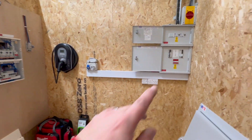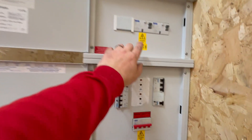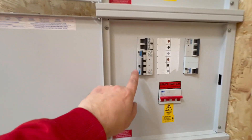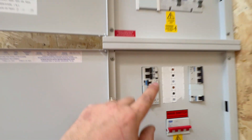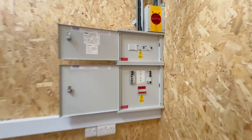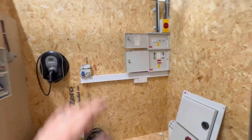This board is in our EV booth. You can see here we've got the old-style Proteus EV board. These used to work via four-pole RCDs that you had to wire separately, or Proteus came up with a pre-wired kit. Then they invented this awesome four-pole RCBO that goes straight in the spine board and obsoleted all of that - fantastic for us as installers. We've got a C40 here in this board, and again we've got an isolation point in the booth that turns the energy off into here.